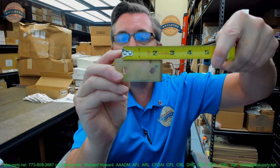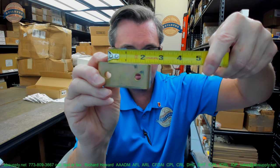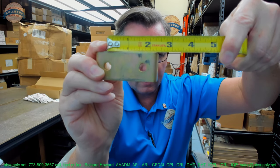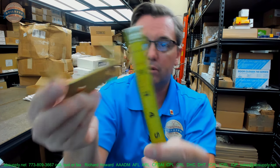The wider of the two, or the lid portion — overall width of that is about 2-13/16ths. The center line of the screw hole looks like it's about an inch and 5/8ths. Overall height, about an inch and a quarter. Its overall projection, about an inch and just heavy on an inch and a half.